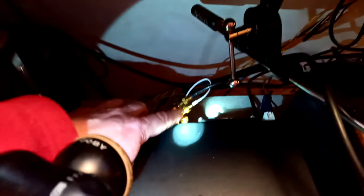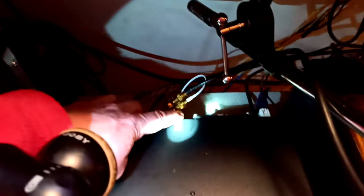You'll need a T. This is the line which goes to the RSP Duo, and you can get all this cabling through Amazon. Don't go cheap. Get some decent cables. This is a gold-plated RCA connector, so what happens is the IF is jumped using this small coaxial RCA jumper, back from one side to the other into the T, and that completes the circuit so the radio can receive as well. And the IF out is taken from this coaxial T over to the RSP Duo.